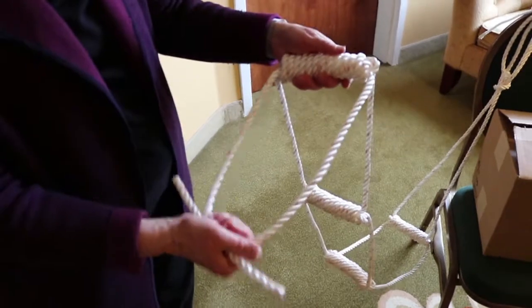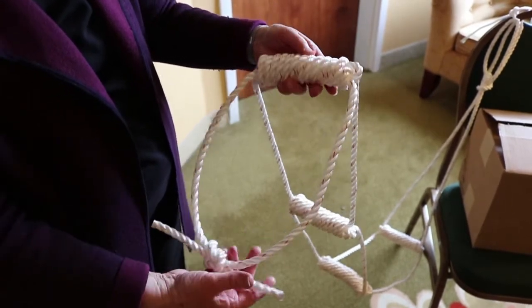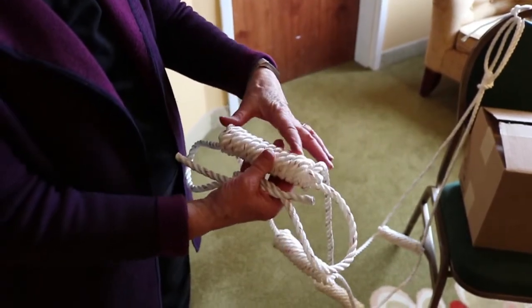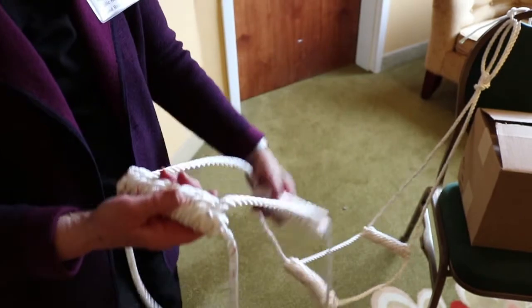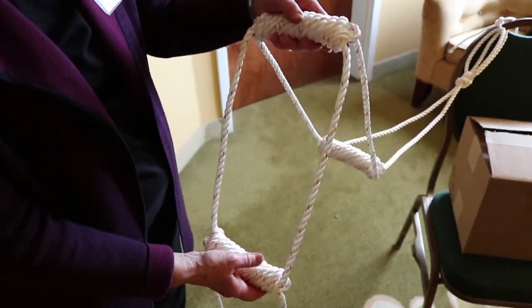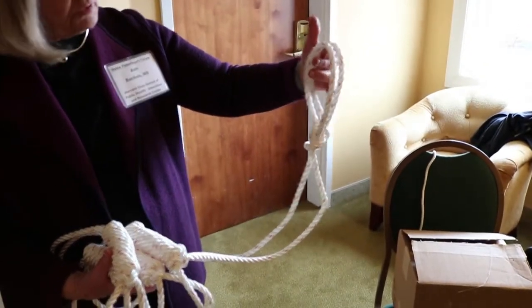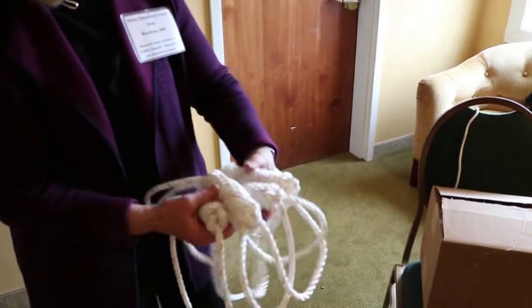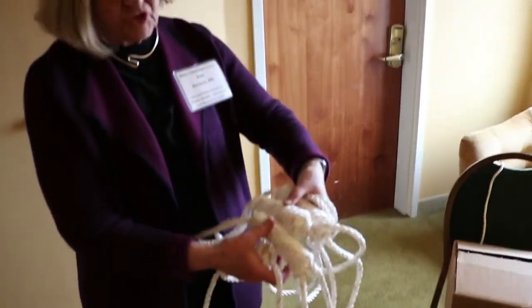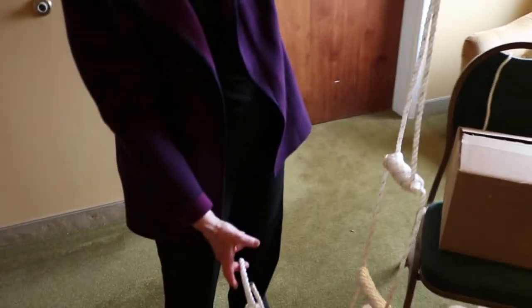This is the bottom of the ladder and it will be in the water when you first start to climb up. The important thing is that you want to climb on a step, not on this bottom loop — that will not hold your weight. This double loop at the top will go over a cleat on the boat, usually a cleat toward the stern. You can hold up the remaining part of the rope with a very light string that you could pull on should you be in the water, and the rope will just fall down into the water and let you climb back up.